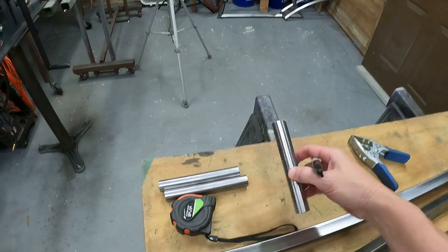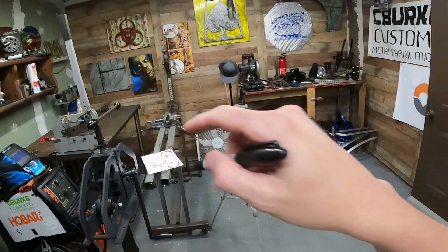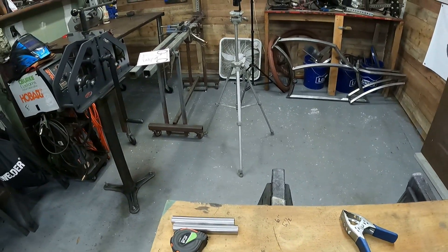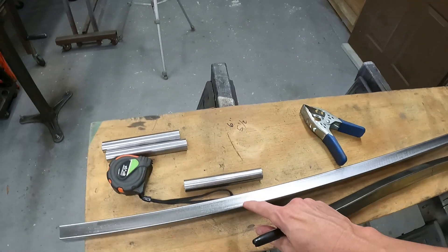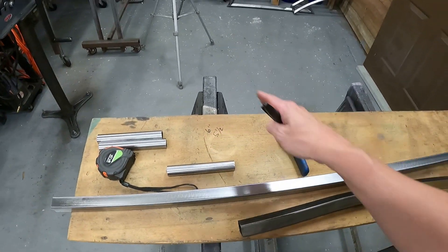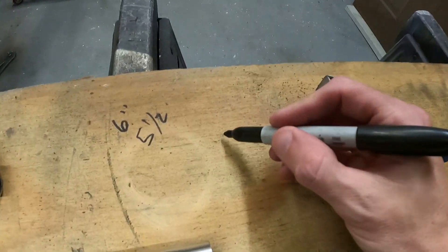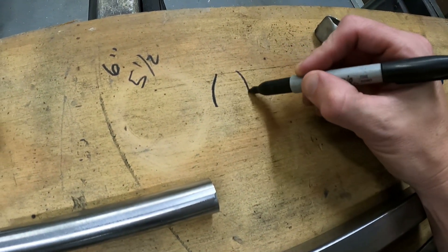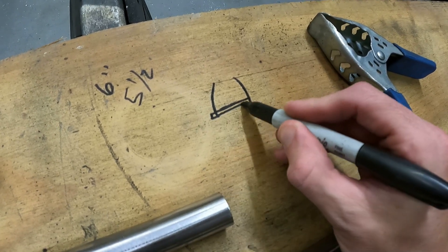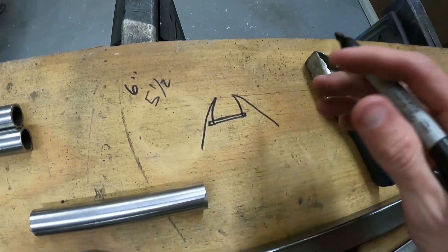Five and a half — this is where the steering neck connects to. One thing about having my tubing notcher is that when I make my pieces that come up on the side, I'm going to cut some seven-eighths holes out of them so that this will actually slide inside of the top part. The bars will kind of go like this here and like this here, and the tube that runs across here I'm going to have go inside so that they can come down on each side.